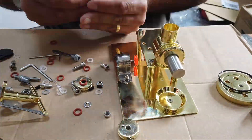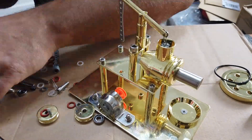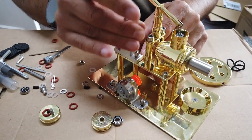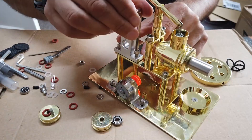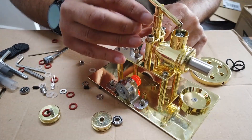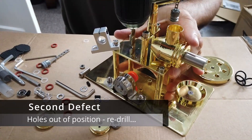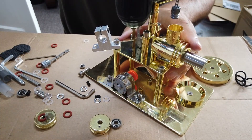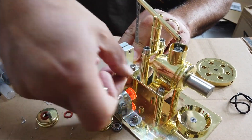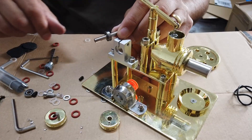As you can see I've got us in high speed mode at the moment and I'm just trying to put the assembly together. This didn't come with any instructions - well, there were some basic instructions but they weren't very good. I went to their website and looked at pictures to figure out the build. The second defect drove me nuts - it's quite fundamental - and I had to redrill this hole to about six millimetres to finally get that screw in place for the bearings on the flywheel assembly.